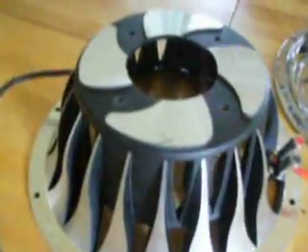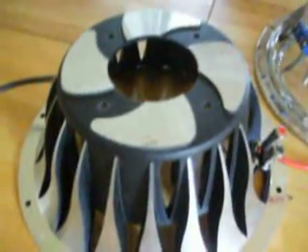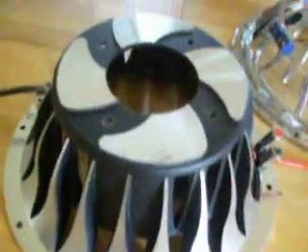Now this is a series wiring. We would run a jumper wire from this negative to this positive. Now if this was a dual 4 ohm voice coil subwoofer, this wiring would end up being 8 ohms. If it was dual 2 ohm, the resistance would be 4 ohms in the end. We just have our jumper wire from the negative to the positive.